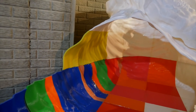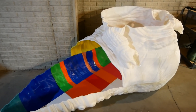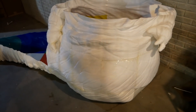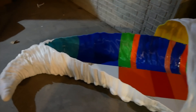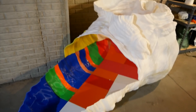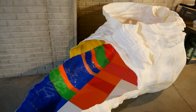If I was going to do something like this again, I would definitely make the shell sections thicker. When I was originally coming up with this plan, I wasn't sure if it was going to even be workable or possible to do this, so I wanted to use as little filament as possible, just to keep the amount of filament used and the time printing down. But I think, in hindsight, making it maybe an inch thick instead of more like a centimeter thick would have made aligning these pieces way easier, and might have even allowed me to put in some sort of pegs or something to help align them as well.